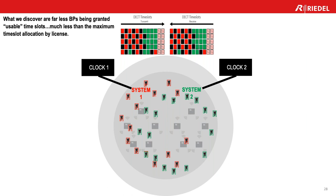But could they just walk into the other area and near field sync to another belt pack or an antenna in the other area? Well, two things are going to happen. There is the chance that that belt pack may occupy its time slot on that antenna inadvertently. But again, it's only going to be for a brief moment in time before the antenna management looks at that belt pack. As part of DECT, I'm going to constantly assign and reassign time slots, and in that instance, that rogue belt pack is going to be gone anyway. Secondly, obviously, the antenna is going to realize that that belt pack is not registered to its logical group, and it's not going to allow it access.